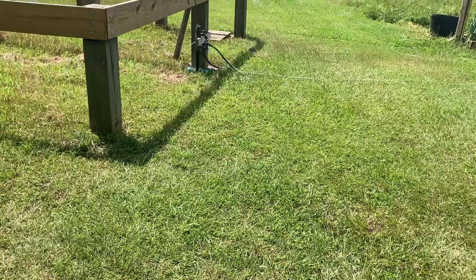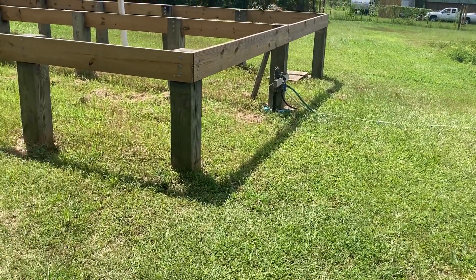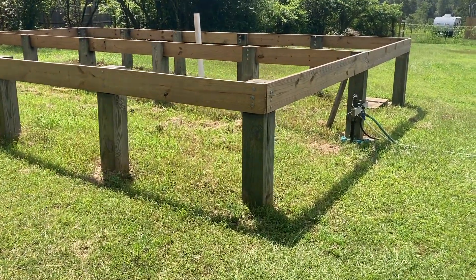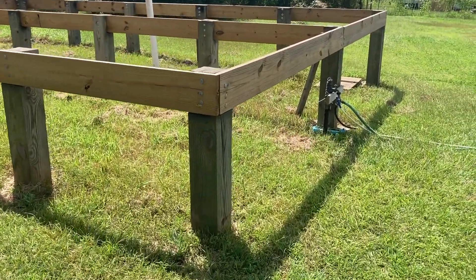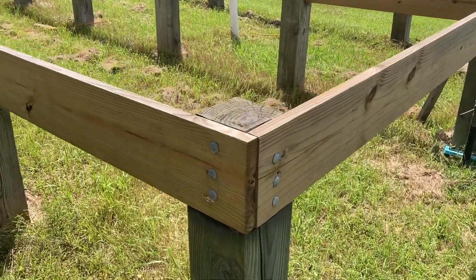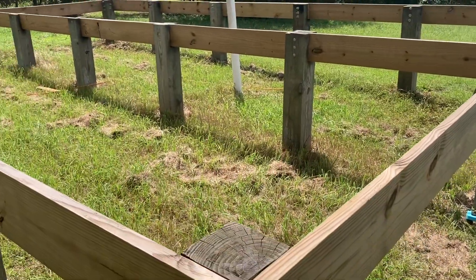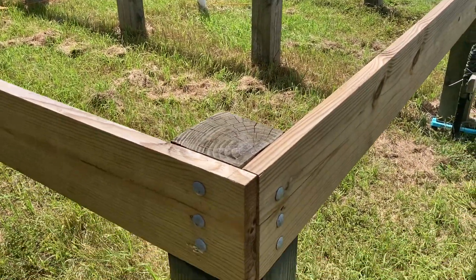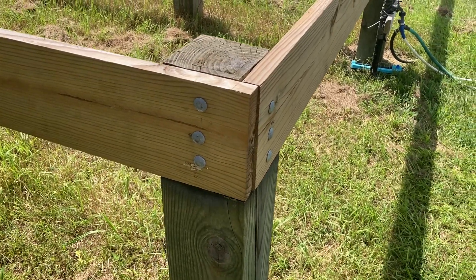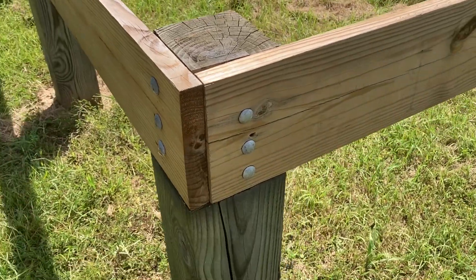Welcome to the Toadstead. This is part of our cabin building series. What you see here are the bolts — big deal, right? But this is actually required and it's not a bad thing. You can see we have all our rim joists on, and these are half-inch galvanized bolts, staggered. This is a corner, so there are six of them.